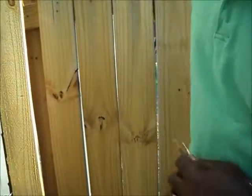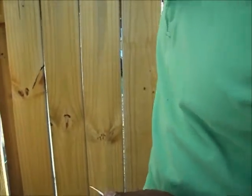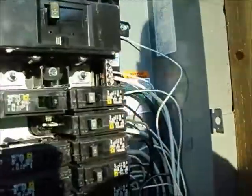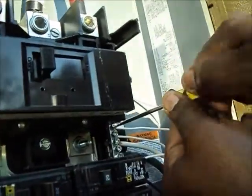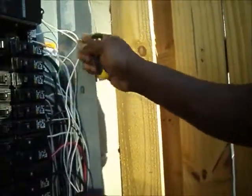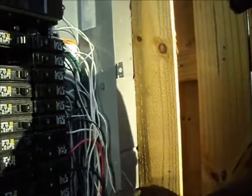Well, to be technical, you can say sheathed. So what you do — you get your Phillips head screwdriver, you find a blank spot on your bar, unscrew the screw a little bit, take your copper and stick it right there into the breaker bar, and screw it down, tighten it down. Check to make sure it won't pull out. Then tuck your excess wire inside the box.